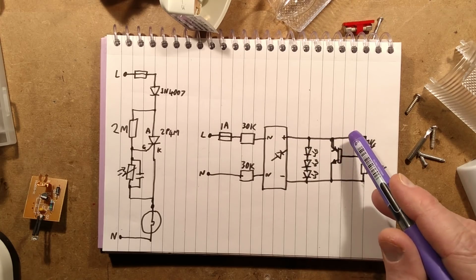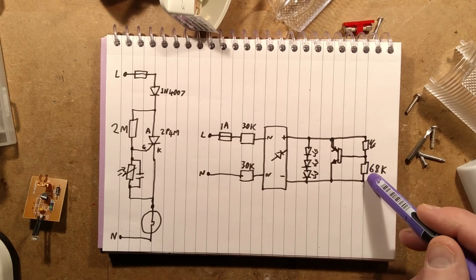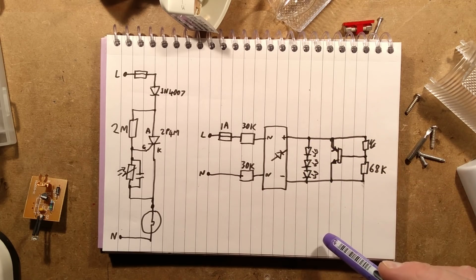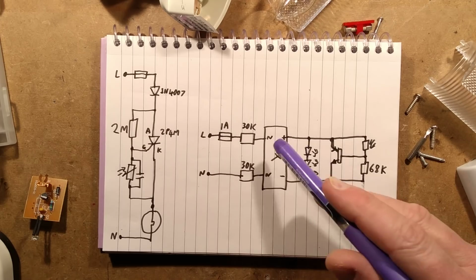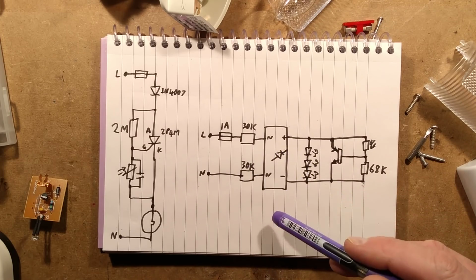It's not a new circuit. They used to use the same thing. They used to actually have an LDR and resistor arrangement bridge to shunt neon lamps as well. Some of the earliest neon night lights would go out during the day. It was a gimmick to make it look as though it was saving power. In this case, it's helpful because it saves the life of the LEDs, although having said that, it's only 4 milliamps going through the circuit.